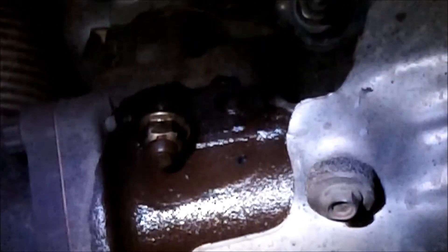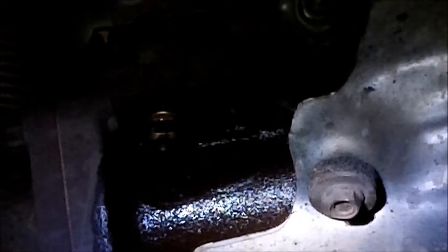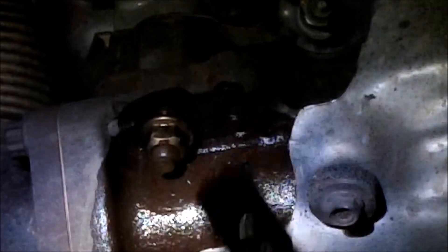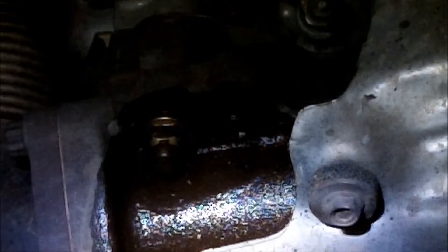Okay, let's see where I'm at right now. I'll keep it coated in WD-40, put my light on there. I've got a 1/8th inch pilot hole drilled. The whole time I'm keeping it lubed with WD-40, and I'm using this big magnet keeping all the shavings off as I go. I've got some metal on there now. I'm going to go up to the 21/64ths and drill the next hole.